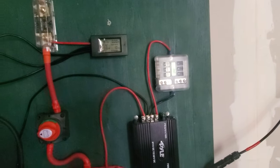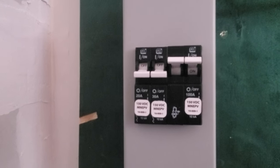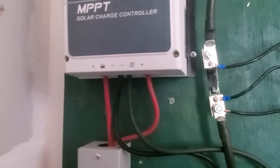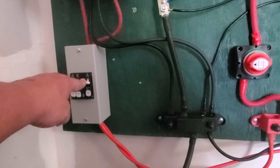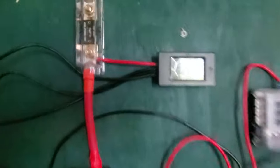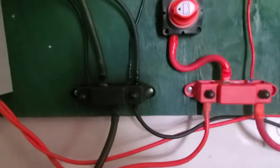The batteries were at 28 and the PV was coming in just great. I disconnected that 20-amp breaker — that's the solar panels — so I have no power now going to the charge controller. Now I'm gonna turn off the batteries from the charge controller to the batteries so nothing is connected. Now the charge controller is completely off. I'm gonna wait till this gets down to zero so I know there's no juice hanging around anymore, and then I'll start disconnecting all the batteries.